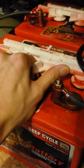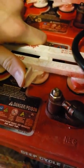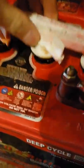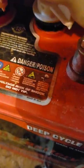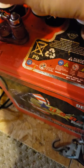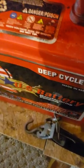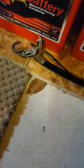For each battery you're going to want to check the fluid. There is some distilled water, and you want to make sure that that's at the right level or else you'll kill the battery. Also, when you're storing it for longer than a day, you should have it off the concrete — that's why there's wood.